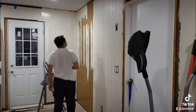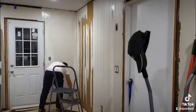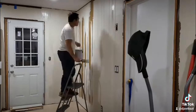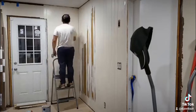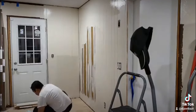After a much needed dinner, I continued on to paint the walls, including the recently installed wall panel. I'm using a paint with primer in a neutral color which will match the paint color of the kitchen in the next room. I started with a brush to cut into the tight spaces and to make sure the valleys in the panels are thoroughly painted. Afterwards, I finished painting with a roller to get better coverage across the rest of the walls.